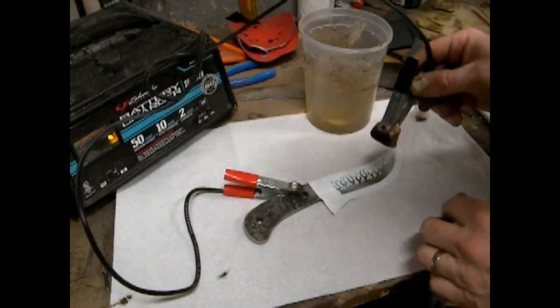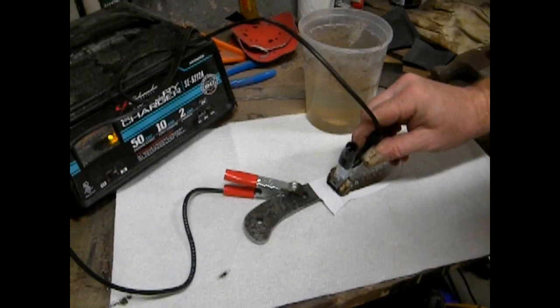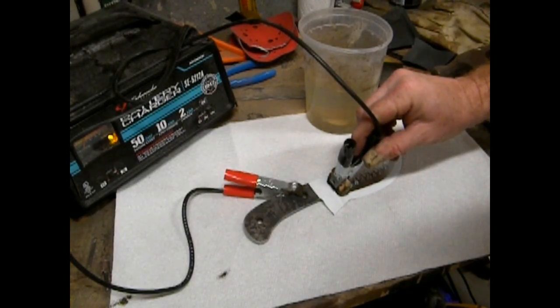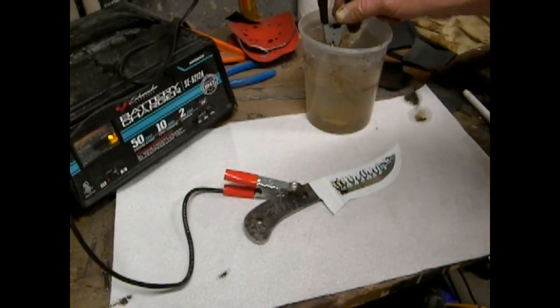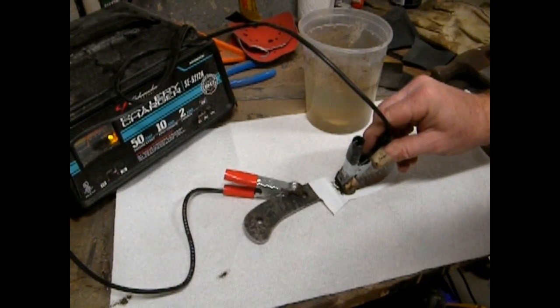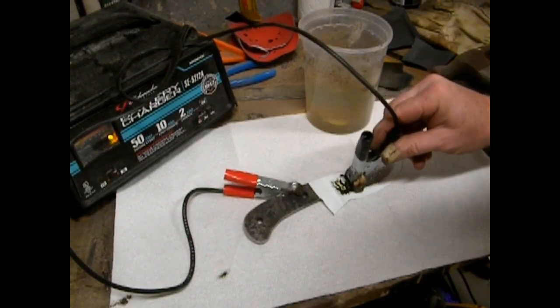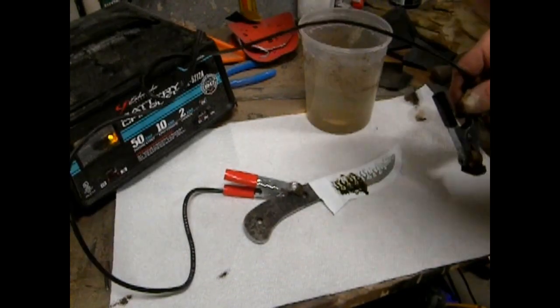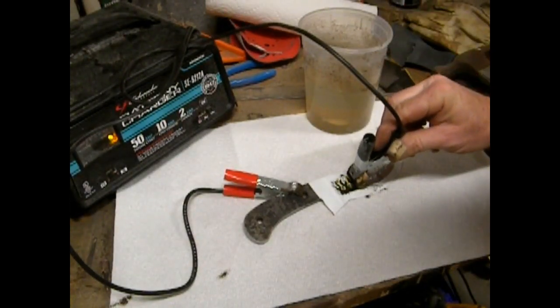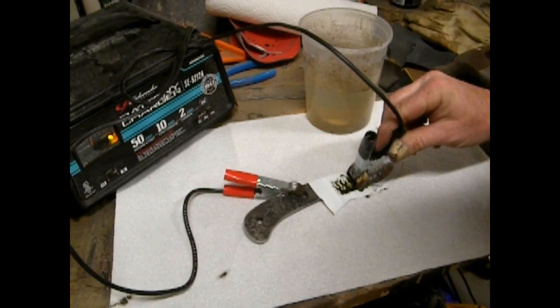This paint will also block the etching, so you'll end up with some additional shiny lines on dark flames. The etching process is done with an automotive battery charger — a 12-volt charger. I've got mine on 50 amps. You could experiment with different amperage, but 50 happens to work nicely. I've connected the positive clip to the knife, and I'm on the negative clip. I've taken a piece of gauze, wrapped it up, and I'm dipping that into salt water — a quart container of water with about six tablespoons of salt. I'm moistening the gauze in the water and then applying it to each section of the knife. You don't want the gauze to be completely saturated, just damp — you don't want water running over the edge of the knife; you want it to stay on the section you're etching.